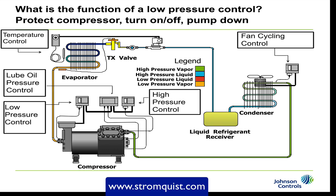We're also using the low pressure control to turn the compressor on and off. The temperature control is connected to the liquid line solenoid valve. When the temperature rises in your space, the temperature control will make contact and energize the solenoid valve, allowing refrigerant to enter into the evaporator. The pressure will rise on the suction side of the system, and when the low pressure control senses the pressure going up, it will allow the compressor to come back on. As the compressor pumps and we bring the temperature in the space down, the temperature control will de-energize the solenoid valve once satisfied.